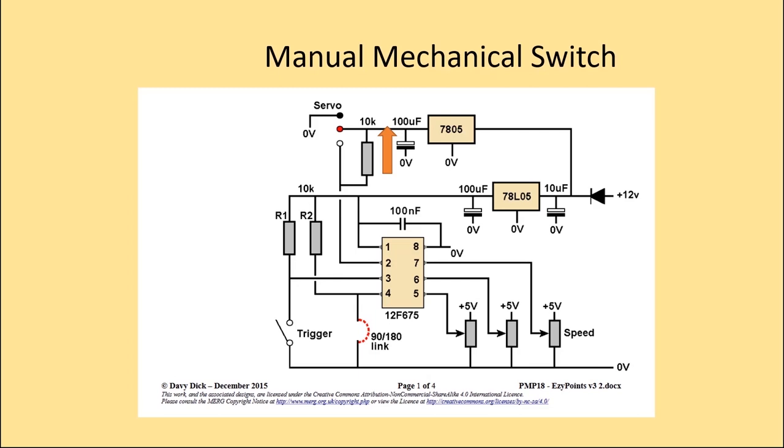However, there are drawbacks. It requires an additional switch and the associated wiring. It also requires the second switch to be thrown manually. And in the case of the crane, if the second switch is thrown too early, before the circuit stabilizes, the servo will kick and there is an opportunity for the crane to become damaged. Therefore, this is a working solution, but it's neither desirable nor elegant.